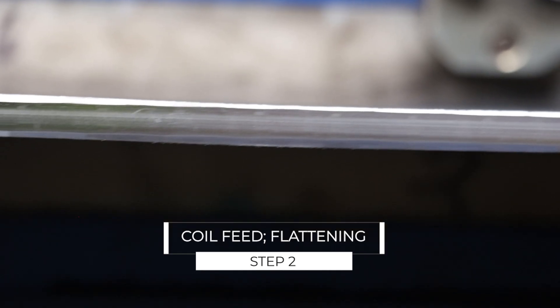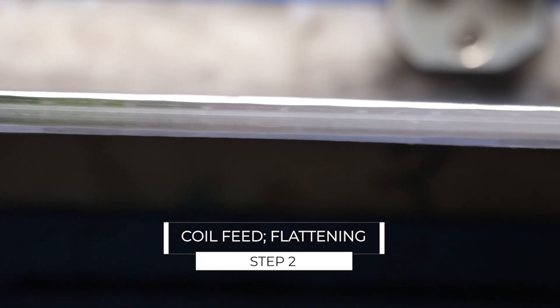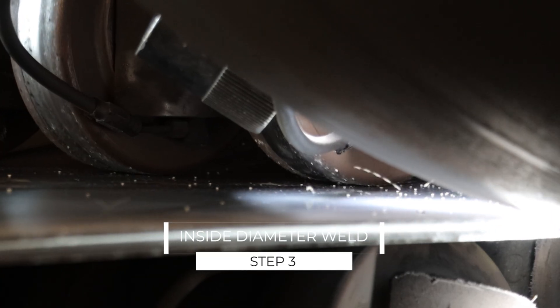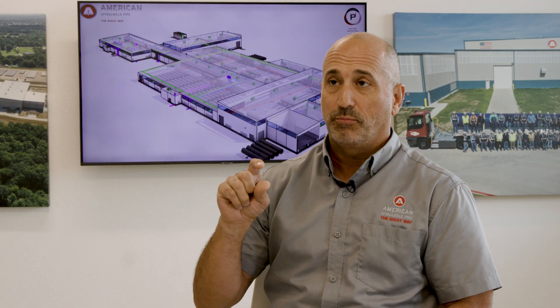After the driver is where the beveling operation occurs. Once it's into the forming section, it's also coming around and getting that first initial inside diameter weld. During that phase, we're actually welding the ID and the OD to accomplish a complete joint penetration weld — a CJP weld in that area.